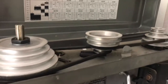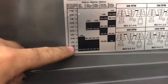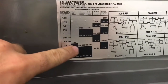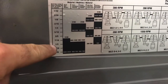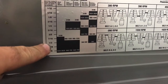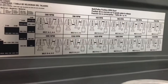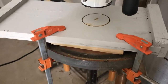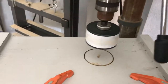We've reset the belts — now we're on 700 RPM. The chart says for drilling through wood you should be on 3100 or no less than 990 depending on hole size. Since I'm using a 3 and 5/8 inch hole saw, I left the speed a little lower for more torque versus trying to blow through it at really high speed. I've got it clamped down because with the belts holding, it might want to grab and throw the piece.